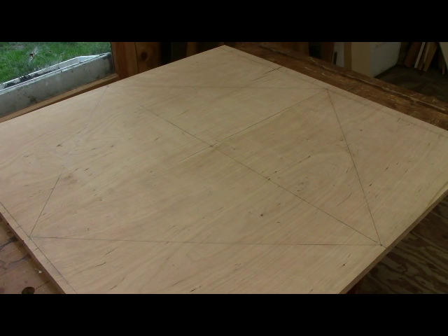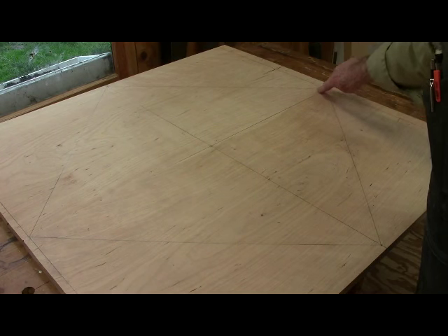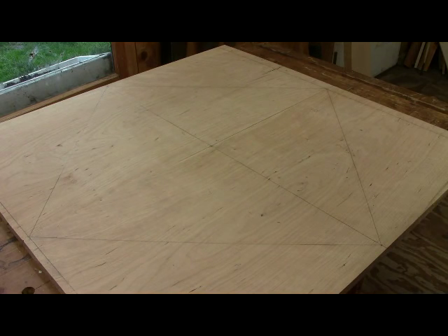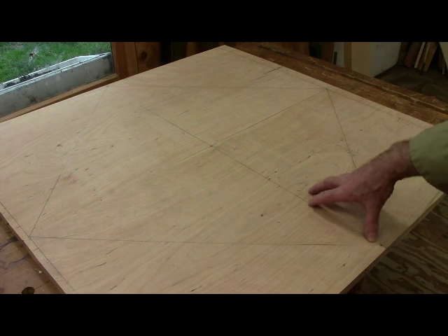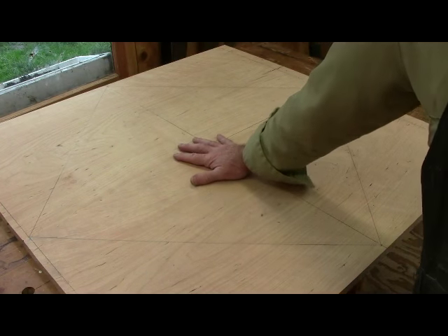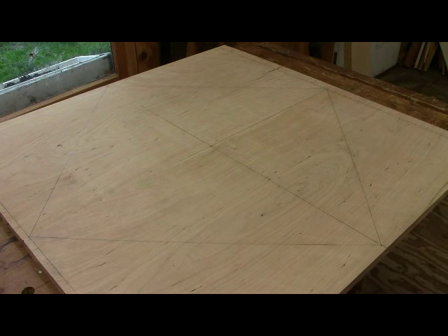I've laid out the square that the top ends up being — it's slightly larger, although it'll get smaller after I put on the baby butt corners. The corners will come in about a half inch across the four corners, but this is the center of the table and I've got 16 and 3 quarters. The plan calls for 16 and an eighth, so it's a little bit longer, but once you take the baby butts off I think it'll be what's expected. The top is 13/16 thick at the moment — the plan calls for 3 quarters of an inch — but it's got to be sanded and scraped so we'll get it very close.